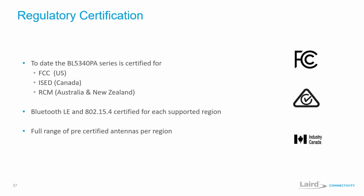There are power table loads for each of the regions to maximize the radio performance for the specific requirements of each region. A single universal power table could be produced, but that would lead to significant performance hits as it would bring down all of the settings to the lowest common denominator to get that single power table, so invalidating some of the optimizations in the different regions where power can be increased.